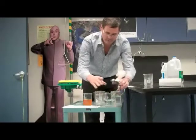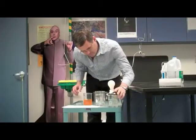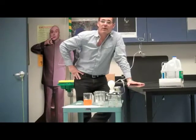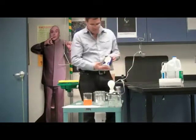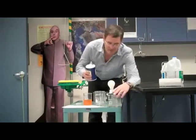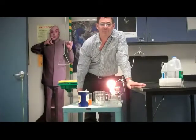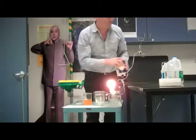Next I'm going to take some tap water from the sink and place my bulb in there. You can see that the bulb does not light, because tap water also is not a very good conductor. What makes water a good conductor is having dissolved ions in solution. So I'll take some ordinary table salt — sodium chloride — and pour it into the water. You'll see that as the salt dissolves, the number of ions in solution increases and the bulb illuminates. It's dissolved ions in solution that causes the water to be conductive.